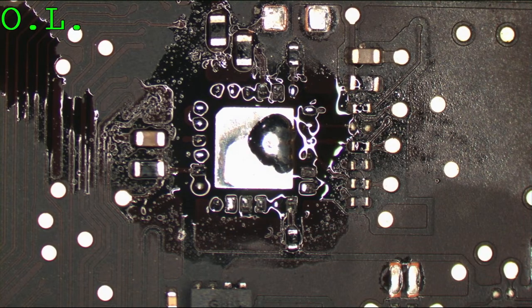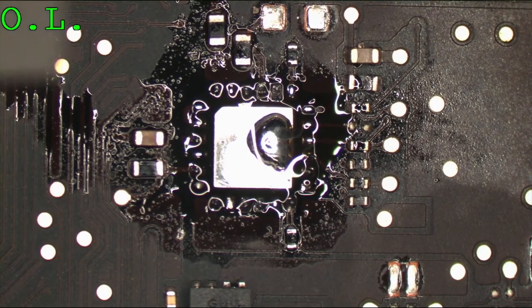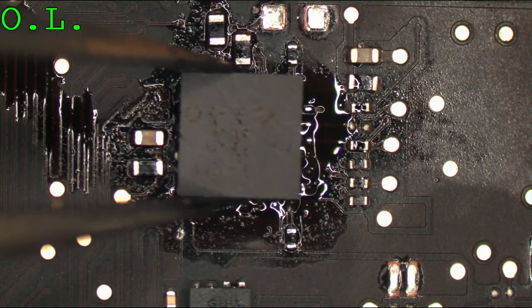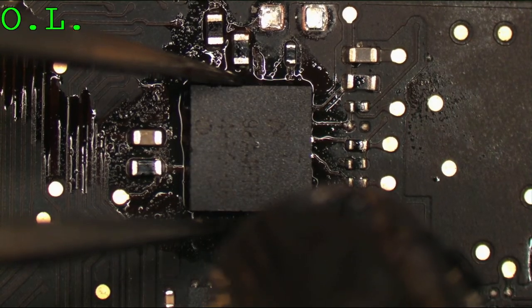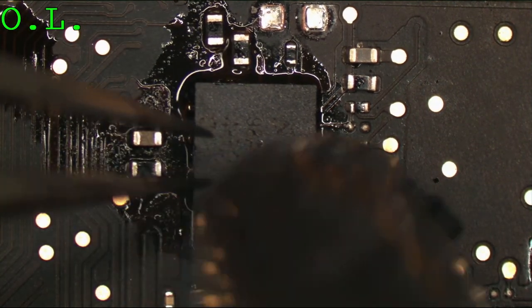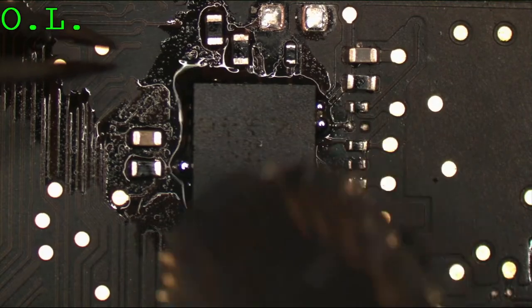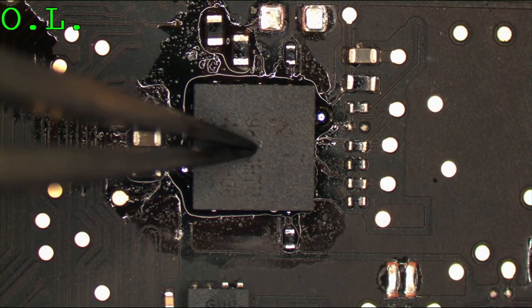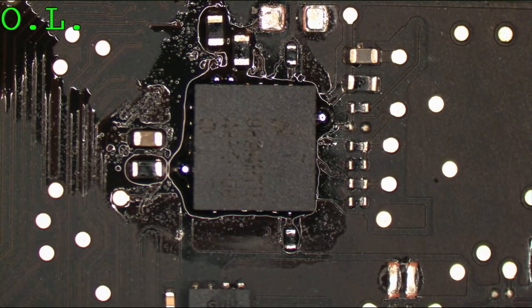Now our pads are nice puffy little pillows. You get a little bit of solder on that ground pad in the middle there, and it will help the chip to float right in the middle, and it will basically self-align itself onto all the other pads. It just dances itself right in the middle, give it a little tap down, get some solder blobs out the side. Now let it dry. I'm going to hold it down, straight down in the middle, heat it back up, let go. There you go. Now we'll get those solder blobs out of there.